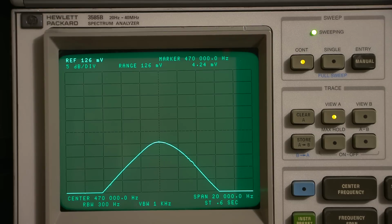Some of them are on the rear, and the tubes are in the way, so I've got to move everything around. Okay, so here we go. I'm going to move that bottom capacitor. So you can see I'm moving the gain around, and now you can see I'm actually shifting the center. So what I want to do first of all is tune for the maximum at 465. I can move this here. It actually shifted it in the right direction, so right about there. If I move the marker over, see, I'm about 468 now. You can see how much that shifted it.